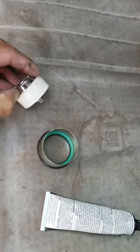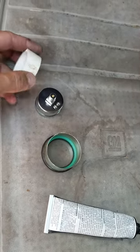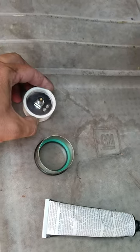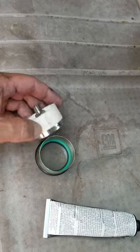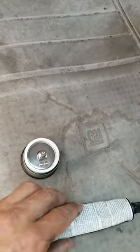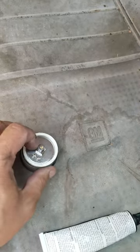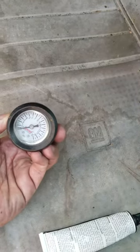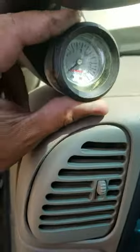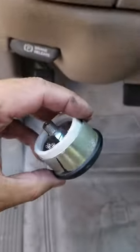The white ring around this gauge is inch and a half PVC. I cut a slice of inch and a half PVC — it goes over the gauge, and the gauge drops into here. What I do then is silicone the PVC into here, and you have your gauge. Then your gauge can mount in there and it's now two and sixteenths.